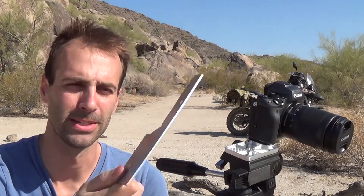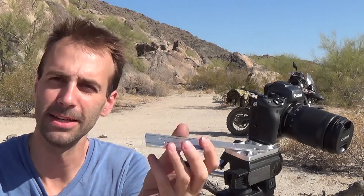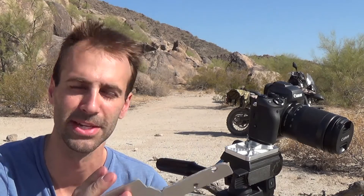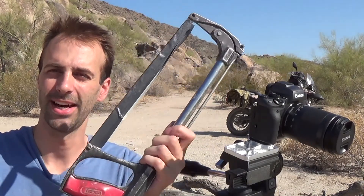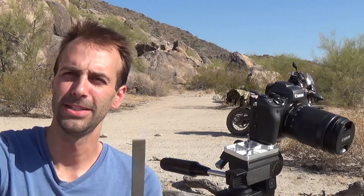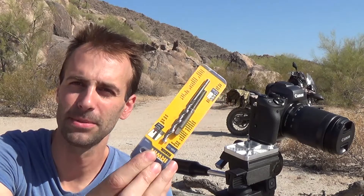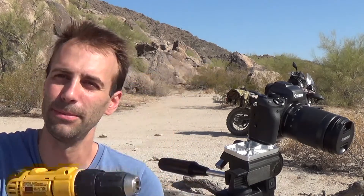I realized that we're not all going to run out and buy CNC machines to make our own bracketry or pay to have somebody make it. But this was the prototype for this, and it's made out of eighth-inch aluminum and it's fairly rigid. It does the same thing, and I made this in about 30 minutes with a hacksaw, a file, and a drill and tap. It's not hard, it's not complicated. Once you draw out your profile with a Sharpie, you can take a hacksaw and cut it out. Then to make it pretty, just take a file and file your edges straight and bust down all your sharp corners. Then you can get drill and tap sets — get a quarter-20, they're like five bucks at the hardware store. It comes with the tap, drill, and everything. If you don't have a drill, borrow one from your buddy, buzz the holes through, and that's it. Your bracket's made.